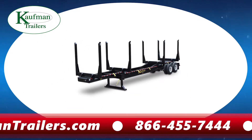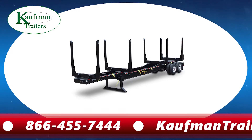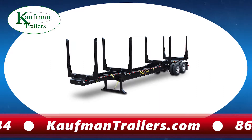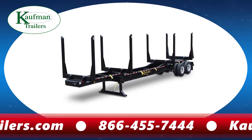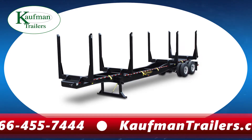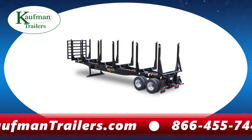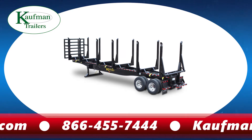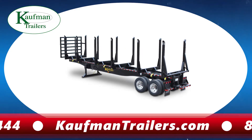Kauffman Trailers offers a full line of log trailers for sale in three different industry standard configurations: straight frame, plantation, and flat top with sliding bolsters. All three models are built with fully fabricated 42-foot mainframe beams that utilize 130 KSI heat-treated flanges and 80 KSI webs. Each model also includes full-depth fabricated cross members, a heavy-duty push bar and drag bar, continuous formed bolster caps, and 36-inch bolster standard gusseting.